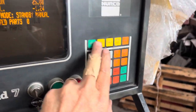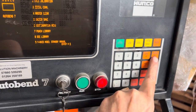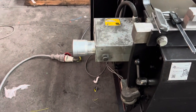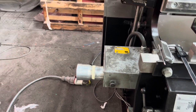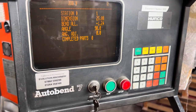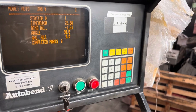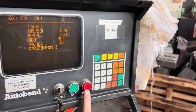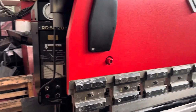To get back out of Standby Manual, go back to Mode, press 9, enter, and you're back to active. Press run and it will recalibrate. These are a good system — they've been around a long time, they're reliable, you can still get most of the spares, they're very accurate and they work very well. They complement the machine very nicely.